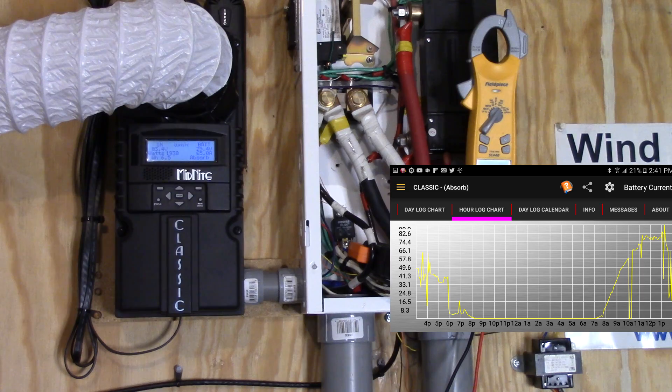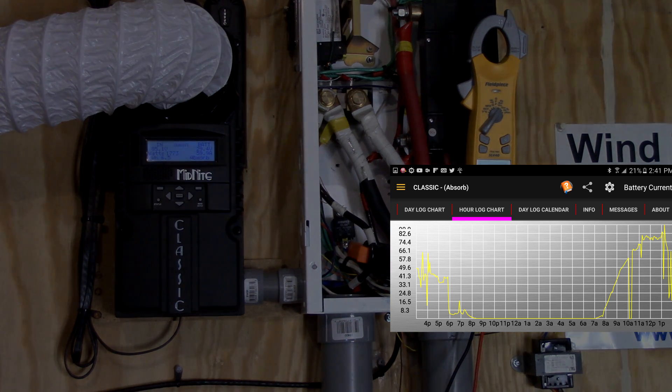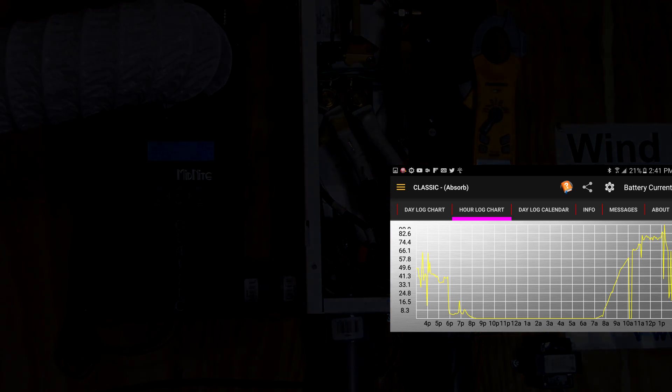I don't know — maybe the panels just aren't capable of full output when it's 90 degrees outside, but I recall it doing it before. I'm running about 2200 to 2300 watts, and when I spray water on the panels it gets up to about 2500 watts, which is around 94 amps. So it's not all the way up there — maybe it's just because it's really hot and cooking those panels. Tell me what you guys think. This is Phil20 with Solar Power Electricity and Electronics — like, subscribe, share, comment, and I'll holler at y'all later. Peace.